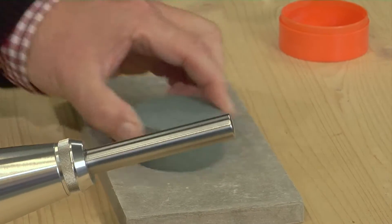I have brought here a plate with me. It isn't concrete, but as long as the surface is flat it works. There is also a grinding stone included to make it flat. There are also special gels which you can put onto the surface. You shouldn't do measurements next to each other — there should be a minimum distance between them, depending on the material, and one location should not be repeatedly measured. Normally, 16 measurements are required: you remove the top 3 and bottom 3 values, and take the average of the remaining 10.